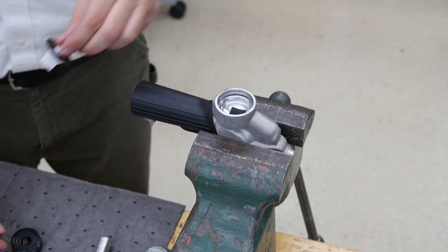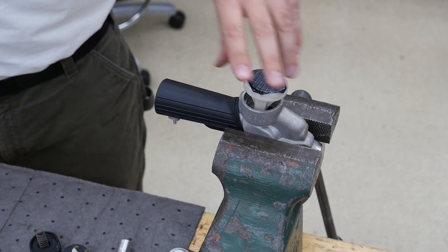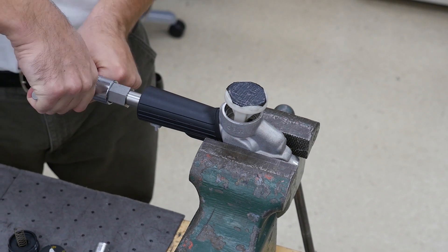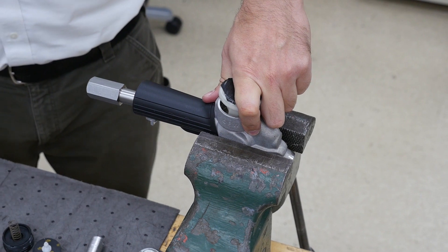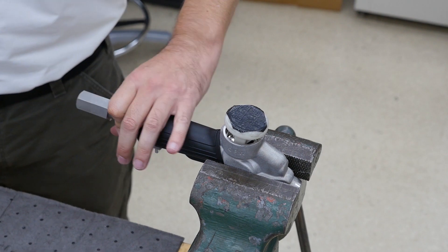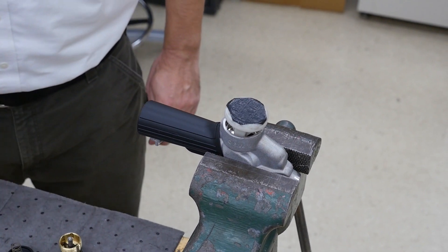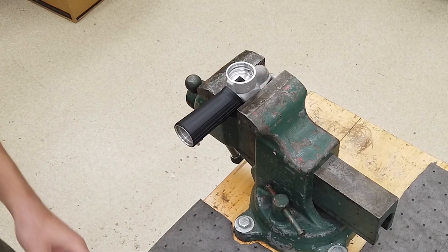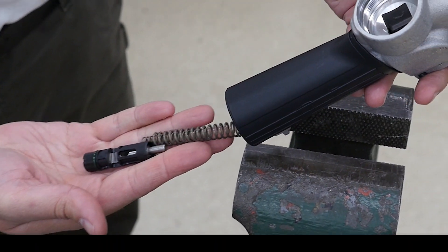Since the valve assembly is under tension, you must use the stem stop block to maintain the tension as you remove the valve assembly. Place the stem stop block into the diaphragm opening and be sure that the tip fits into the groove inside the diaphragm opening. While ensuring that the stem stop block is keeping the tension, loosen and remove the valve assembly. Once the valve assembly has been removed, push in the sleeve with the stem hand press and then remove the stem stop block. The sleeve, stem, and two springs should slide out of the nozzle body.